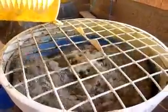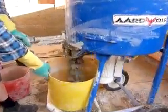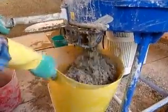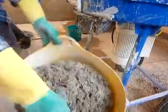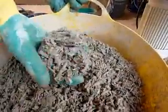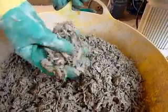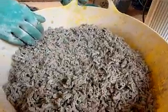We pour in the excess water that ran out, and this is the finished mix coming out of the mixer. We place it into flexible buckets as they're easier to carry and move into the formwork. This is the finished mix — a good consistency. If you squeeze it into a ball, it just stays together; it doesn't crumble apart too easily and it doesn't stick together too much.